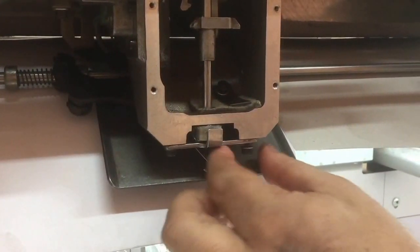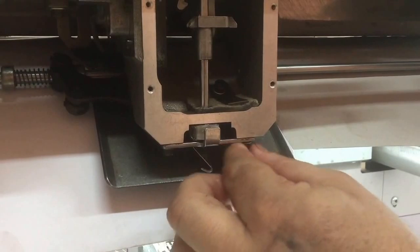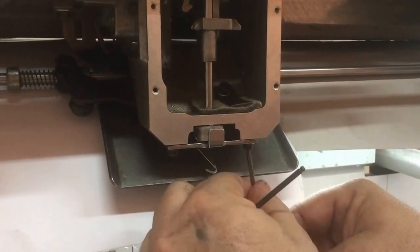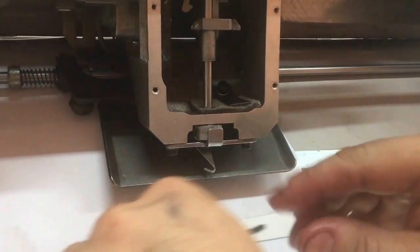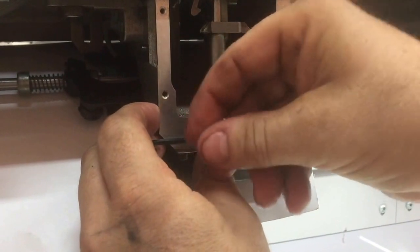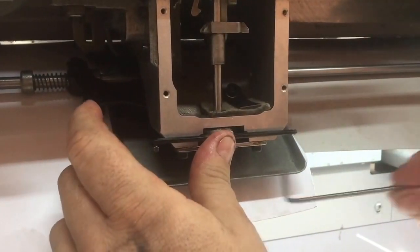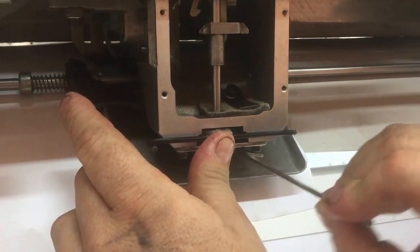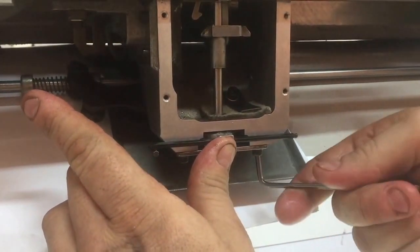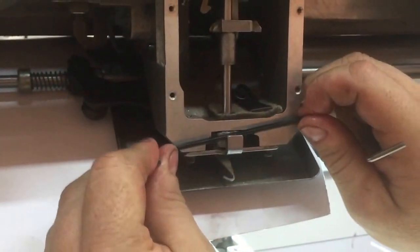Okay, it's an M3 Allen bolt, 3mm Allen key rather. Just lightly snug it up, and then use a second M3 to set the spacing between the roller and the front tang. Again, you're into aluminium, so no need to do it up super tight. That clearance set.